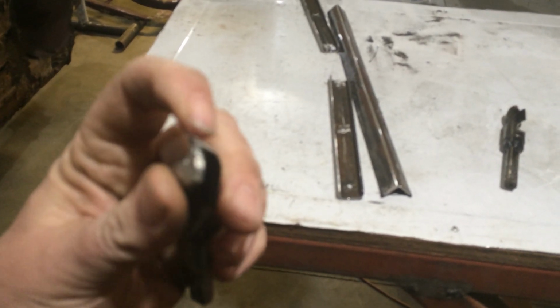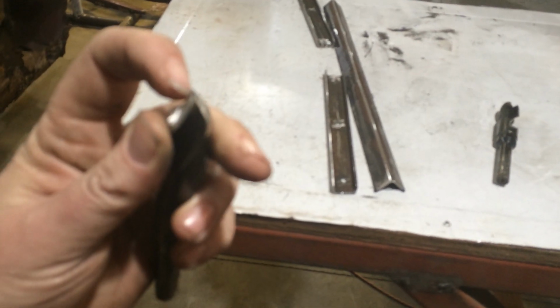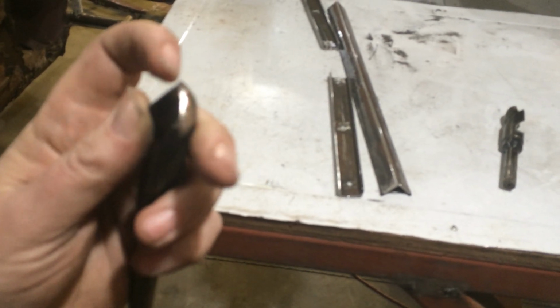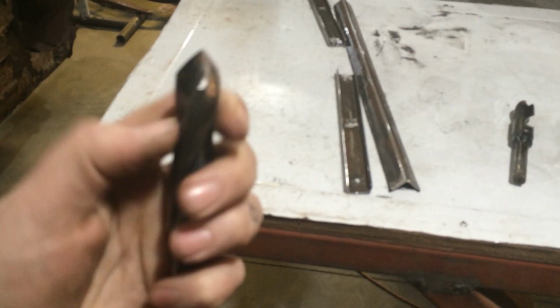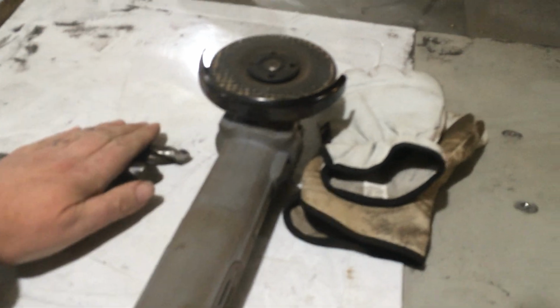And then on these bigger parts, because they really do have quite a wide nib on them, you can undercut at the tip too to leave it narrower, so it has a good bite. You'll probably be doing a pre-drill hole for these bigger ones anyway, but like I said, that's what I do with these. And once you sharpen them, these guys will cut like a bugger. Like, you'll stall out your drill press if you're really reefing on it. But just a handy tip, one of my many useless facts that I have kicking around.